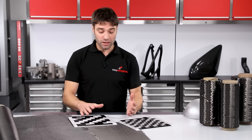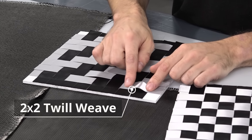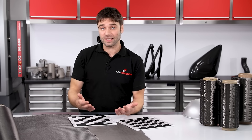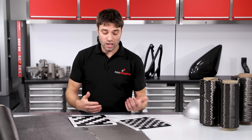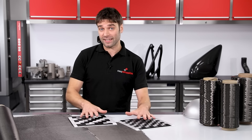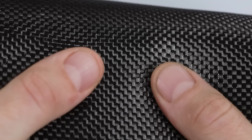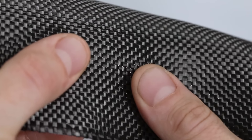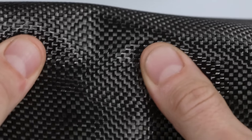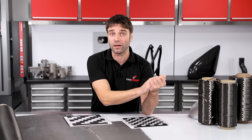In the twill weave we have exactly the same fiber running in both the warp and the weft, but in this case each one goes over two tows and then under two tows. It's essentially the same cloth with just the pattern changed. The main differences apart from the obvious aesthetic difference are handleability and drapeability. The plain weave, having twice as many places where the fibers cross, does bind itself together better, making it less prone to fraying and snagging, and also less likely to warp.